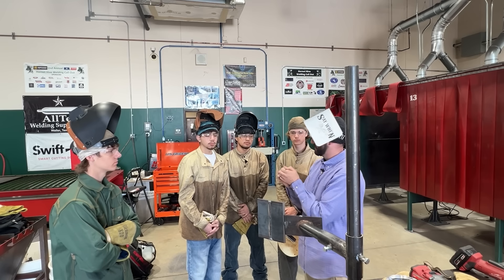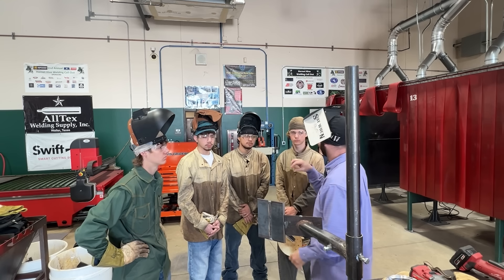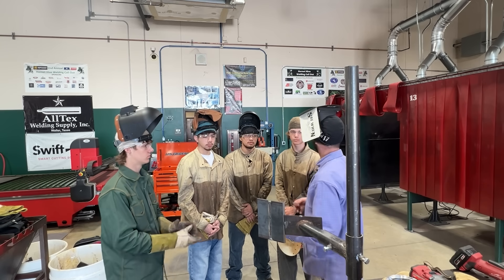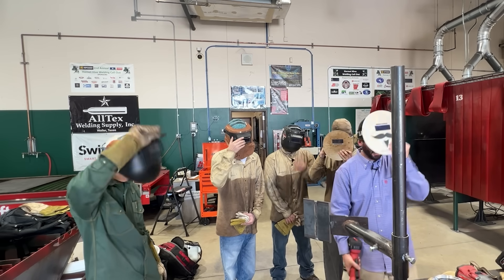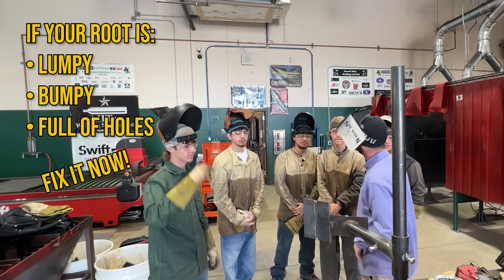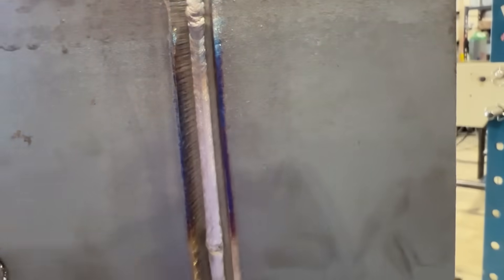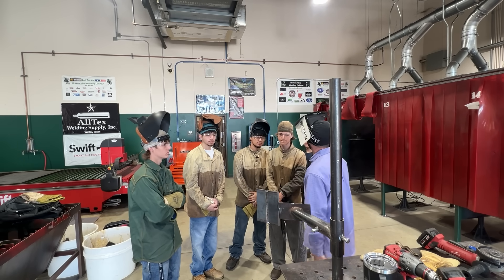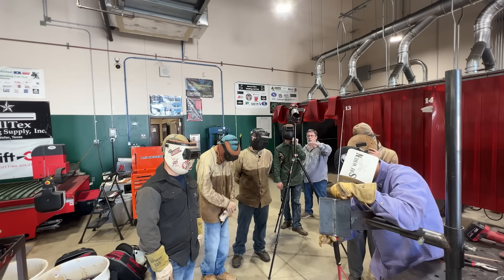Compared to the first half, this root is poking out more with more reinforcement — the wire was easier to break in and sink through with the hotter amperage. This wire has deoxidizers like silica that grab out any trash and float it to the surface — the same glassy stuff you've seen on MIG welds. If your root is lumpy, bumpy, or has holes, fix it now. This front is super clean — nothing to grind. But if you have bumps, grind them flat before you continue. We're going to put in a hot pass now at 200 amps.